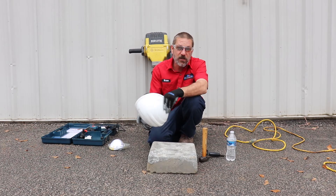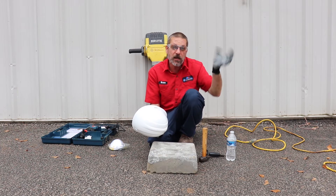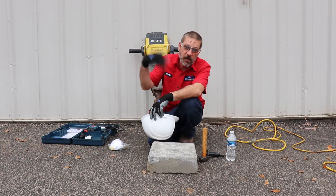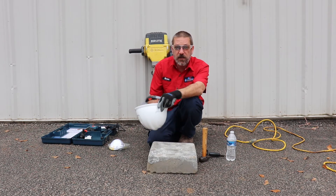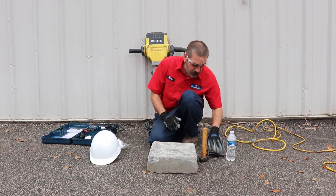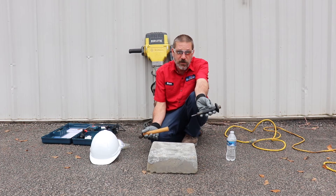If you don't have a dust mask, douse the surface with a little bit of water. With chipping specifically, you're not going to be running into that dust as much. The other thing is you're going to want to wear a hard hat, especially if you're on a rough-in — framers love to carry handfuls of nail strips up into rafters and forget about them. If you go in there with a big jackhammer or chipping hammer, you're going to create a lot of vibration and that stuff can fall out of the rafters. Now I'm outside so there's not really any danger, so I'm not going to wear the hard hat, but I've got my manual drill and drill hammer and I want to show you how this works.